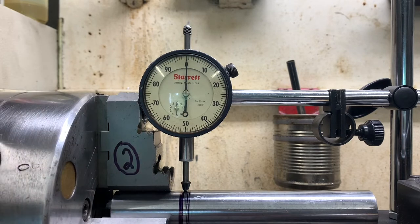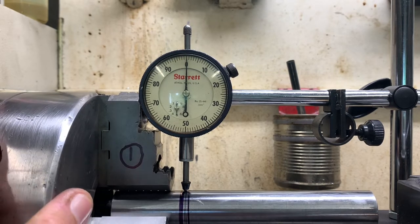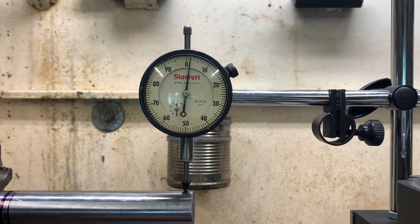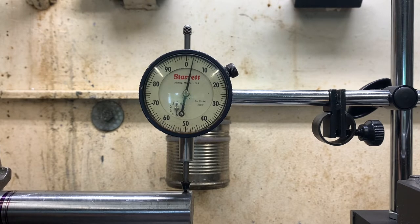There is jaw number two, straight up. And jaw number three, straight up. With jaw number one up, I'm going to go out to the end — you can see the indicator moving — and I've got about two thousandths on the indicator. Going to jaw number two, putting it straight up, we've got about three thousandths. Now with the third jaw straight up, I'm about three and a half thousandths below zero.